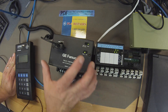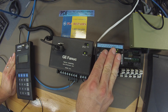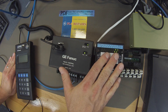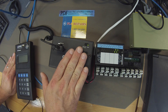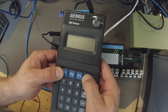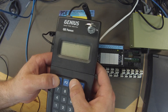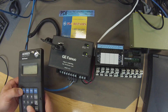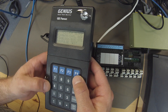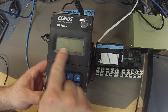Here's what we have so far. We're able to program the GBI to tell it that there is an MDL740 on slot number 1, then have the GBI tell the slot to turn on its outputs. So I know that part is working. The next thing is to make sure that it's working with Proficy Machine Edition. I'm going to turn off those outputs by hitting force, unforce, then go back to outputs 3 and 2 and unforce those as well. Now we have our outputs in the off state. If you go to home, F2 for analyze, F4 for pulse test — there are currently no faults. This is where I would go to read if there's any current faults, but there are none. So that's your fault screen.